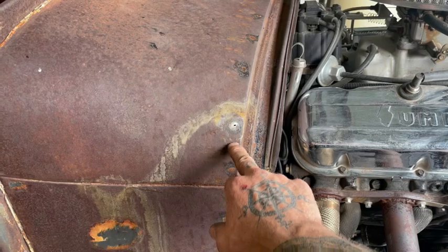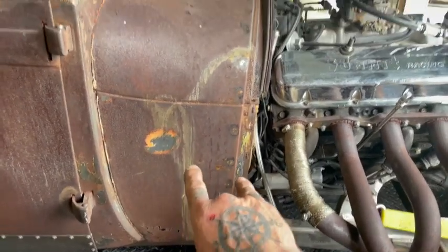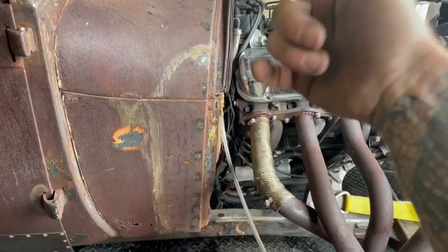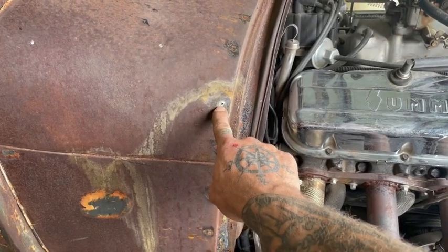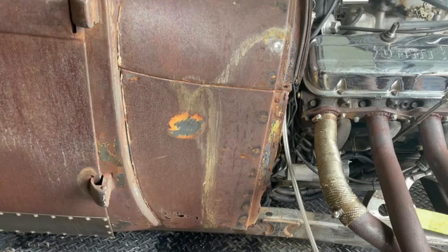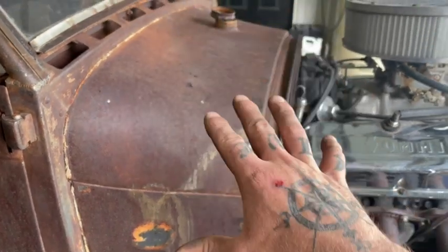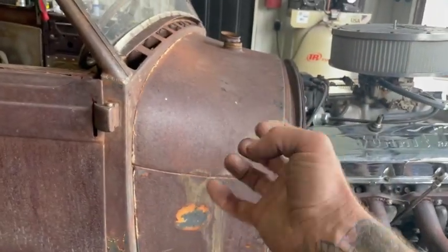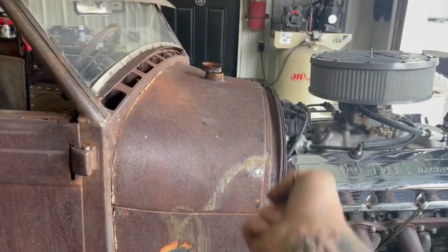This hole — I know why it's there. It's not from rust; this tank is actually pretty clean inside. There used to be belt-fed 50 cal shells that wrapped over this cowl, and all the spots where it was tack-welded on — when he pulled those off, it just pulled a little metal out right there. So we know this isn't a rust hole, which is going to make it a lot easier. We're going to try and TIG it. You could use a wire feed — it'd be faster and easier — but I just trust that the TIG weld is going to seal it a little better than a MIG. So we're going to let this flow for a minute, let it fully fill up with argon, and then I'll do a flame test — I'll take some fire right over the top and see if it pops.